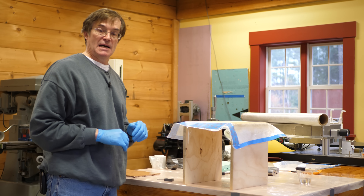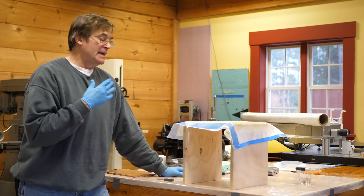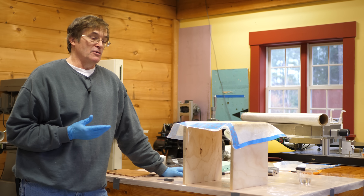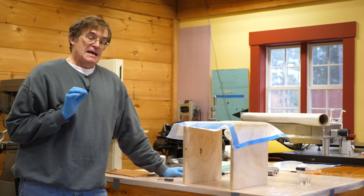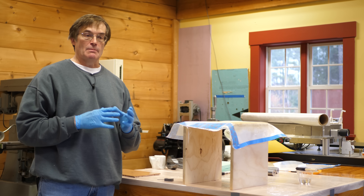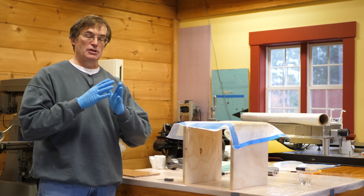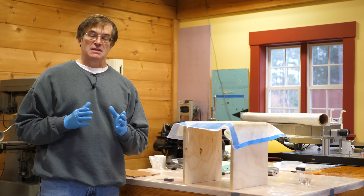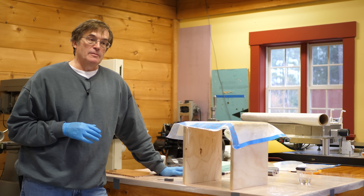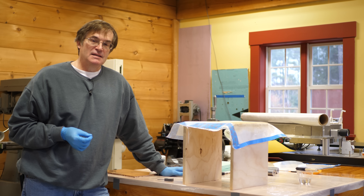So those are pretty simple techniques — temperature, timing, and using gravity to help you. Epoxy coating can be very, very powerful as a tool for boat building. It's easy and it's fun, and when you get better and better with it you start to think about new things you can do with it. Next time we're going to cover fillers — using epoxy not just as an adhesive or coating, but actually modifying it with different types of materials to create a structural compound that can fill gaps and dents, and also build up joints that are far stronger than the native material — extremely fast and inexpensive to build. Thank you very much for watching. Please subscribe and try to share what we're doing here. Happy afternoon, safe boat building, and we'll see you soon.